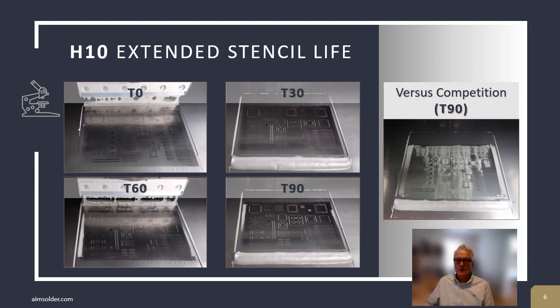Pause to print is one of the tests that we perform to ensure that the solder paste can survive in a high-volume manufacturing environment, but also in mid-to-low-volume manufacturing environments. Any time solder paste pauses, as a thixotropic material, it tends to thicken. The ability for the solder paste to print immediately following the pause is an important characteristic. Breaks or equipment issues may interrupt the production flow, and a solder paste's ability to react quickly and come back online as quickly as possible is an important metric. AIM tests time zero of a 30-minute pause, 60-minute pause, and a 90-minute pause. H10 was able to achieve high-quality printing with no knead strokes and no under-stencil wipes — a worst-case scenario.